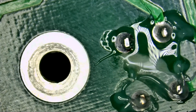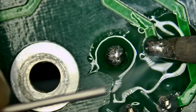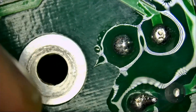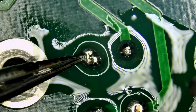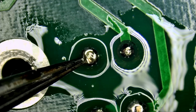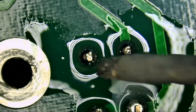We're going to apply low melt solder. The nice thing about low melt solder is when I apply heat — watch this — the solder stays soft, still soft, still soft for about five to ten seconds after removing heat. That will give us enough time to wick off the solder while it's still liquid. That's what's special about low melt solder.